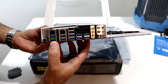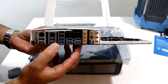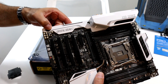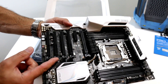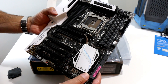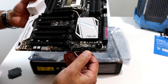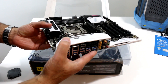On the back side, the I/O panel has a ton of USB 3 ports — 10 to be exact — along with two USB ports, dual gigabit Ethernet LAN ports, Wi-Fi antenna connectors, and the standard assortment of surround sound audio and optical audio outputs. On the top edge of the board is Asus's Crystal Sound 2 integrated audio system with extra shielding around the circuit area to minimize noise and crosstalk. There are five full-length PCI Express slots on the X99 Deluxe with a nice latching mechanism to hold graphics cards firmly but also release the card when pressed, similar to how a memory DIMM slot works. Also on the board edge are features like power and reset switches, clear CMOS, and a debug LED display to show error codes. That's the Asus X99 Deluxe motherboard — a solid foundation for any Haswell-E-based system.